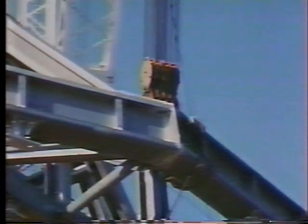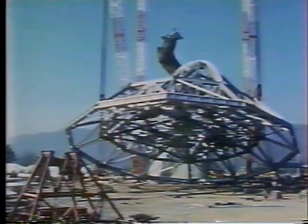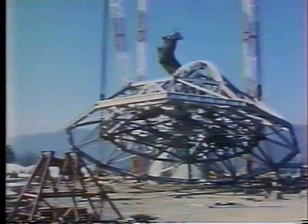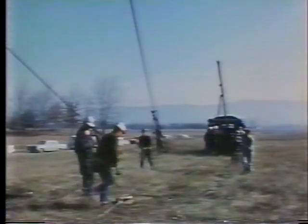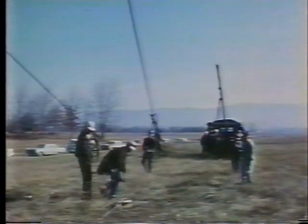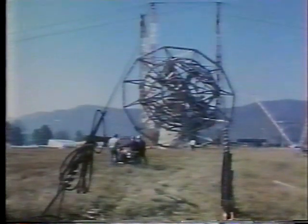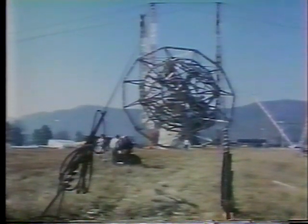All the contractor's top officials are present. The rotation upward goes as planned. Nothing groans or gives. The movable holdbacks have adequate control. The structure is pinwheeled to align its bearings directly with the yoke arm tops when it was found to be some 10 degrees off center.